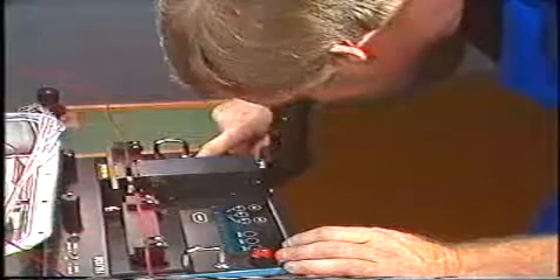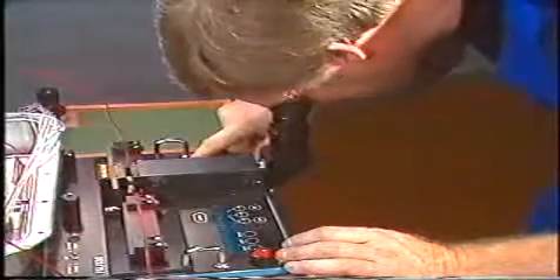The fibers can be aligned in the XY direction by using the touch controls. This is alignment in the X direction. This is alignment in the Y direction. When the fibers are acceptably aligned, press the button marked right and thereafter butt the fibers together.